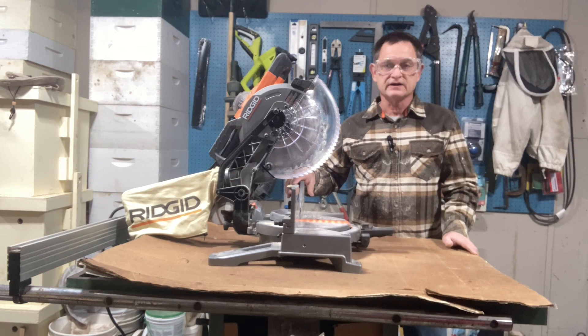I'm now going to use my miter saw to cut the pieces to length. The front and back are fifteen-and-a-half inches long. The sides are nineteen-and-seven-eighths inches long. The shelf is also fifteen-and-a-half inches long and the slats are going to be sixteen inches.